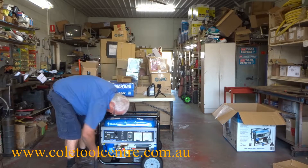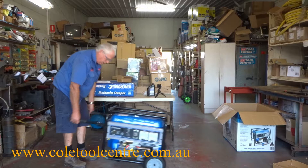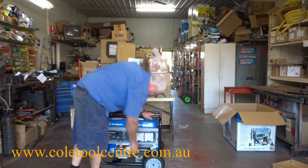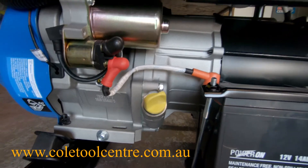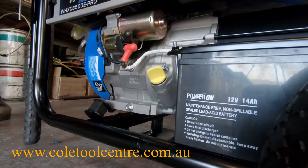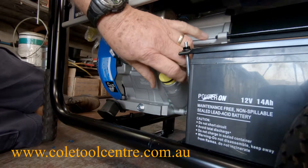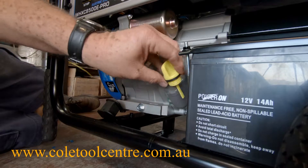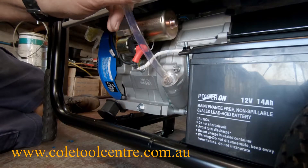The handle is clear so she's very easy to maneuver around — you basically lift it up and push it around like a wheelbarrow. Oil has been drained for shipping. The oil filling area is here, so we pull that plug out, put our funnel in — which has been supplied — and tip our oil in. It has a nice level sight on top of the dipstick, which will have marks on it. Usually your oil level will be nearly to the top.